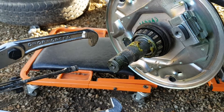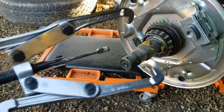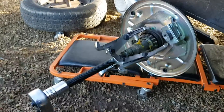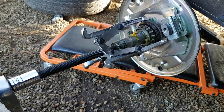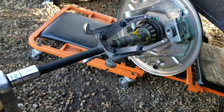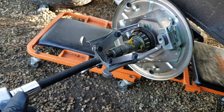This works due to the fact that it's normally a tapered or interference fit. I'm going to pause the video and apply this onto the back. This is what the gear puller will look like once it's applied to the back of the bearing — you can see that the point on the end of the bolt has sat into the dimple, and that keeps it so that it's got something to grip onto.